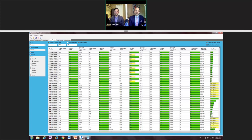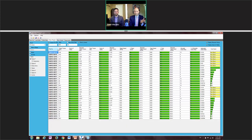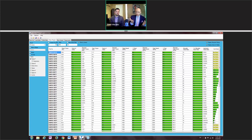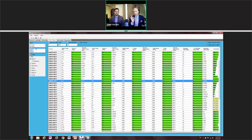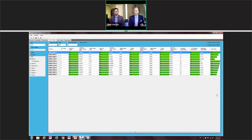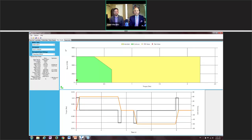Now we come to the Motor Results tab — green is good, yellow means caution, red means something is wrong. We'll look at just Sigma 7 motors. Let's uncheck the torque factor of safety and filter for J-frame motors. Looking at a 200-watt motor — the green results look good. The factor of safety shows what's rated on the motor versus what you need for the application. Let's check the inertia — it's within range and we've got enough motor for the load.